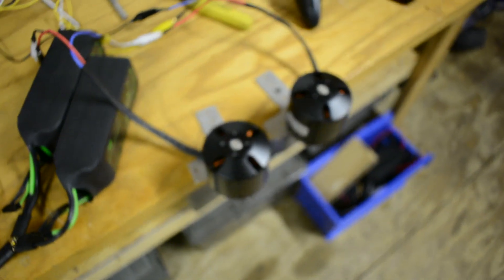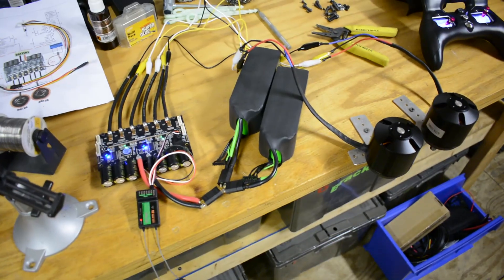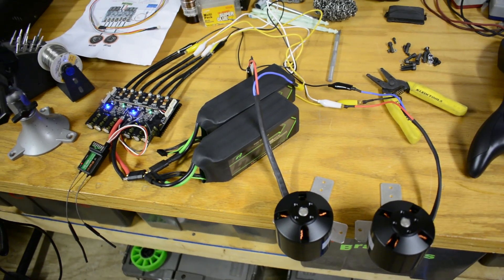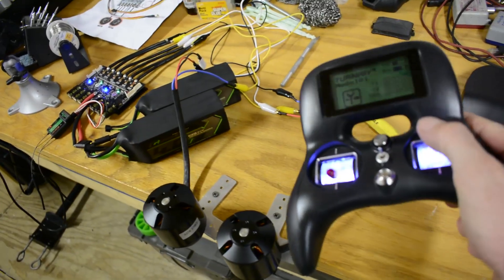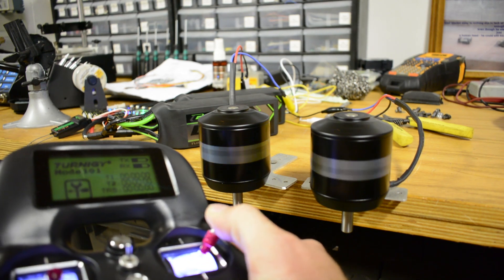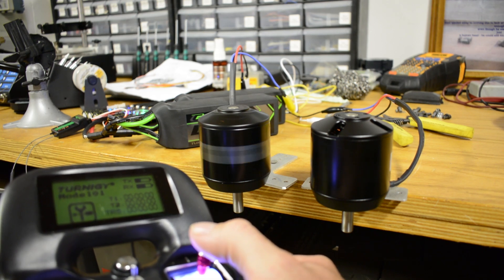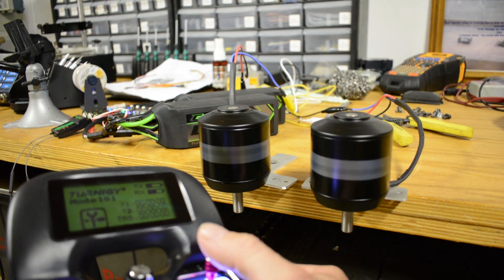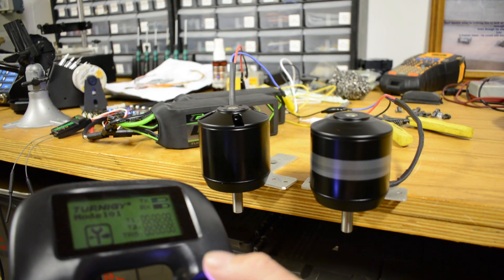I've got these six leads hooked up to two brushless 63-74 motors, and I've got the graphene battery packs wired up in 12s, so this is running at 12s. Both motors are independent and I have them all controlled with the remote. Not only do these motors run faster, they actually run really well slow too. They have great spin-up, really smooth, no cogging. And forward to reverse — slamming it right away — works perfect too.